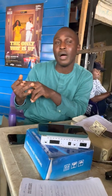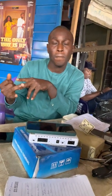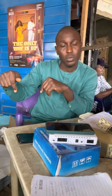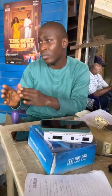So let me start by saying, which number is our main line in your color code? Which pair carries your main line? Pair one. And what's the color code of that pair one? Blue and white. And the redundant line is what? Pair three is redundant. Pair three, we don't use it at all. Are you guys with me now?